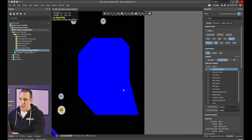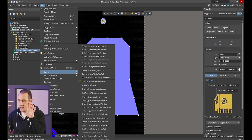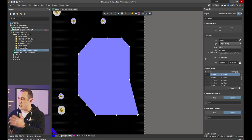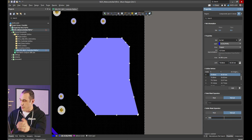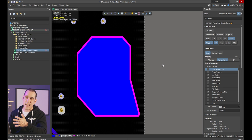A workaround for this is to use the Convert tool. Anytime you want to convert a polygon to another object, you'll find the option in the Convert menu. What I'd do is explode this polygon to free primitives — select that option, click on the polygon, click Yes — and you'll see that when you click on the polygon it has now been converted to a region. Then you can use the rule option or manual expansion to apply the solder mask opening. Selecting the manual option with an 8 mil (0.2 millimeter) solder mask expansion, you can see it automatically fills in the solder mask opening. It's a bit unfortunate that the polygon tool doesn't include a solder mask opening option directly, but the workaround is simple: use Convert > Explode Polygon to Free Primitives, then apply the solder mask expansion as normal.